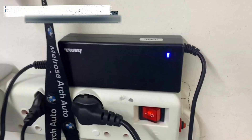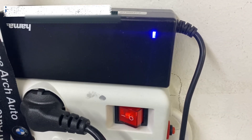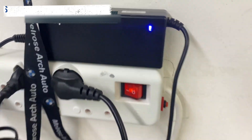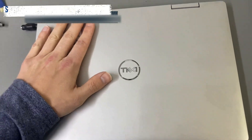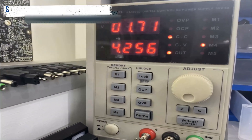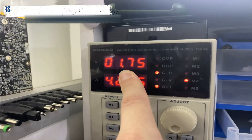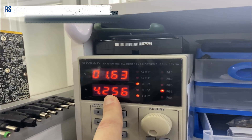When I put in the charger, as you can see when I plug in — as soon as I plug in, it switches off. So obviously we have a short somewhere, maybe one of the main power rails. It is drawing four amps of current, dropped down to one volt instead of 19, and it's drawing four amps of current.